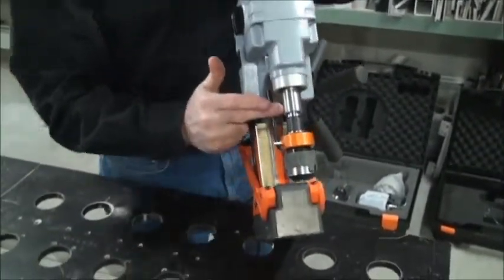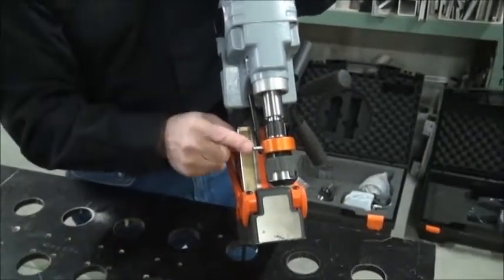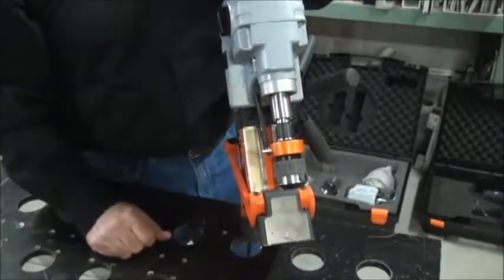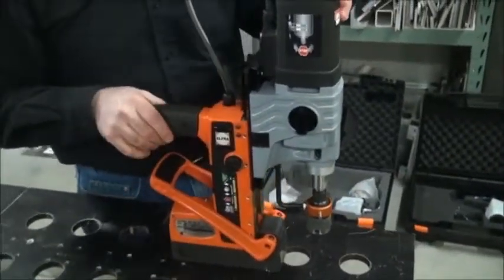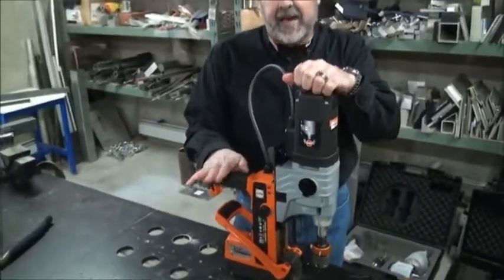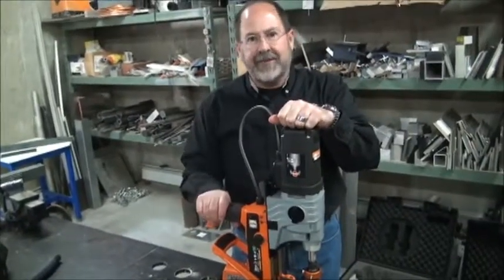What this black bar is for is to hold this shaft from rotating during operation. This shaft is also how you get your through-the-bit coolant — a little quick connect and a coolant bottle hooks up to that. It gives you through-the-bit coolant, the most effective way to keep those bits cool. That coolant bottle actually mounts right here to these two screws on the side. That's about it for the RB50SP — this is our top-of-the-line unit from Maglogix and Alfra Technologies out of Germany.